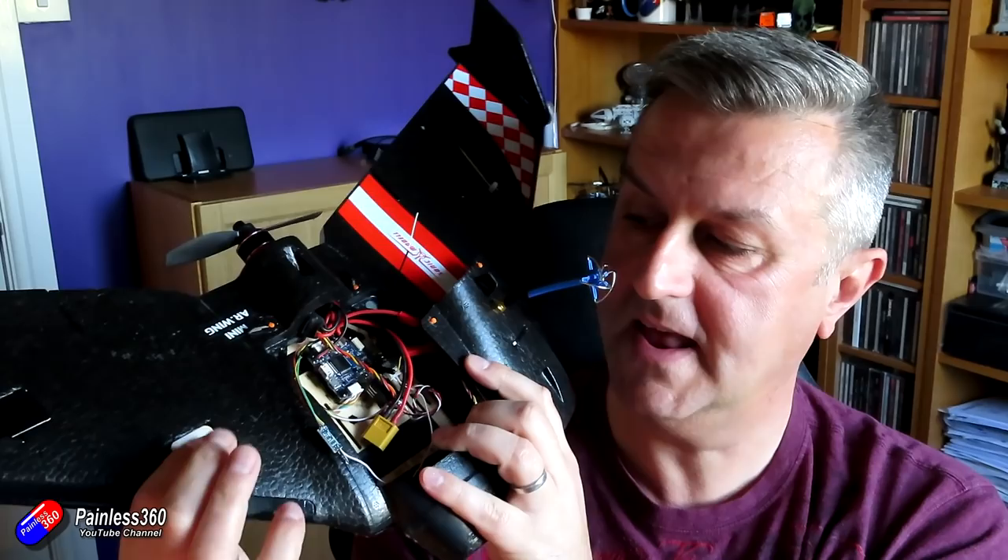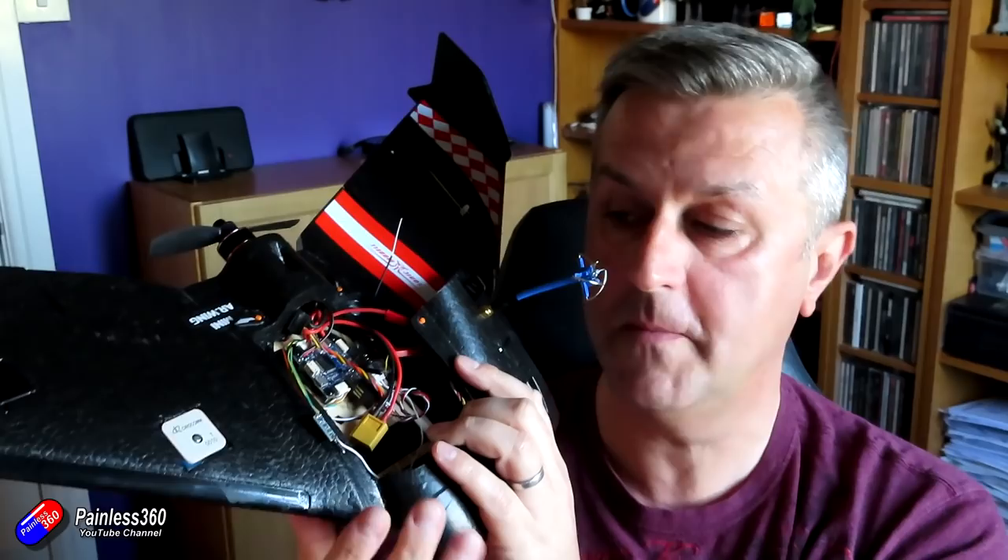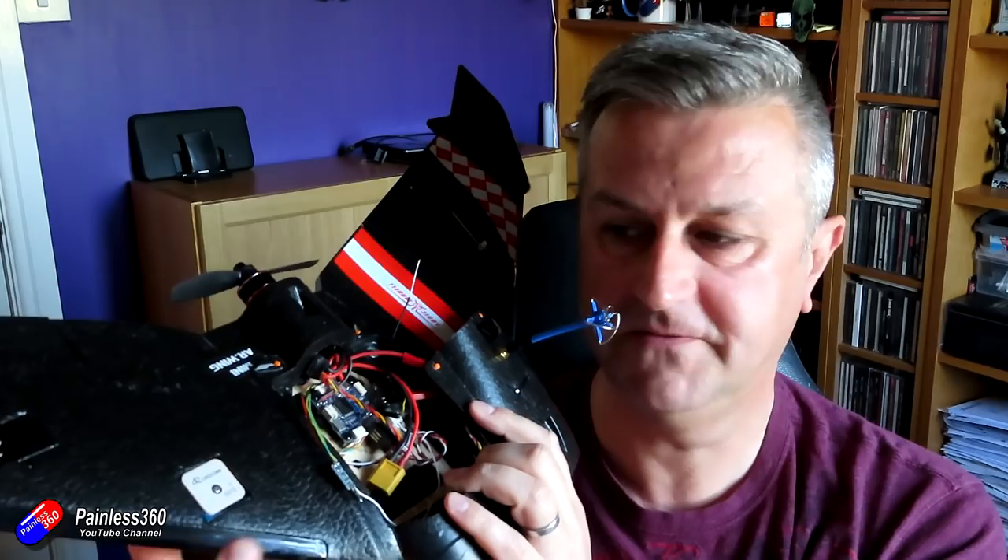In some of the other builds I've done with iNav and things like Vector from EagleTree — I'll put links to all of those series down in the description below — I've disabled the compass in everything else apart from ArduPilot builds. And why is that? Because actually in ArduPilot you can also disable the compass. Lots of people are saying don't use the compass, it's really hard to set up. The reason is that the compass is going to be affected by any kind of magnetic field — either directly from any large magnets on the model, or from strong electromagnetic fields coming from the power system.